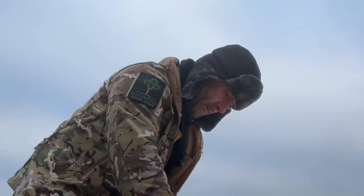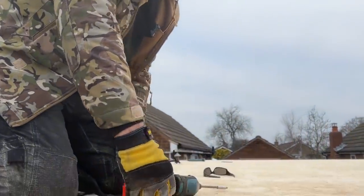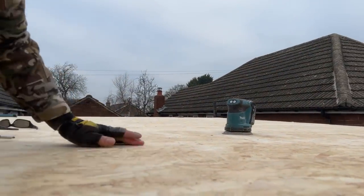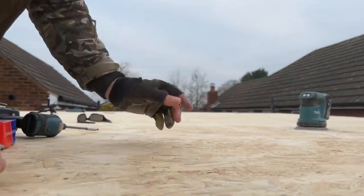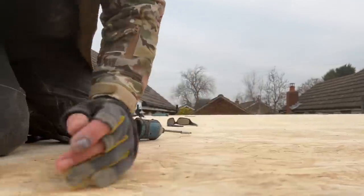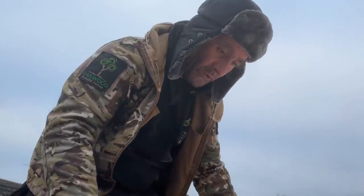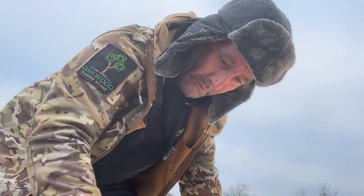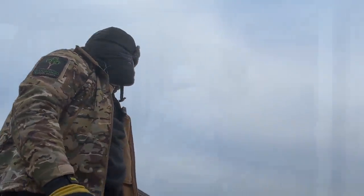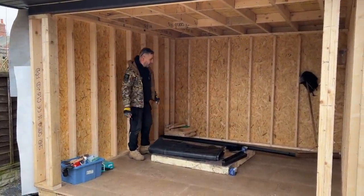I'm going to get all this rubbish off the roof. Davey's going to throw me a brush up and I'm going to get it swept to an inch of its life, because you don't want any dust. You can see that dust on my fingers — you want all that gone. If you want to be particularly thorough, we normally use a blower, but if you want to just get it brushed off and maybe get the hoover up and just go over it and get every single bit of dust off — that's what you want, nice and dust free so the rubber is going to adhere to it properly.